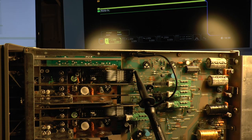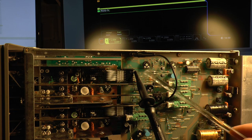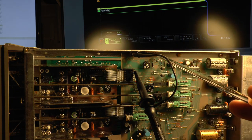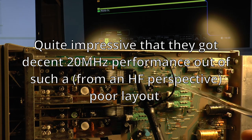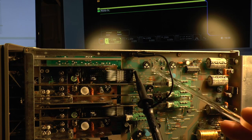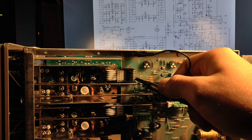I've now set up for probing. First, I connected to the topmost pin. For a ground I've used this chassis screw — I know you might say it's high frequency, but first of all we're only trying to measure about 20 MHz, and second, this screw actually seems to be one of the closest ground references to this thing. The copper ground plane goes straight to the capacitor ground we measured earlier. This is a single-layer circuit board — you can see how the tracks are snaking around; it's not a low-impedance layout anyway. In this case having a little bit of extra ground impedance isn't really going to make a big difference.